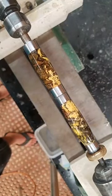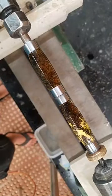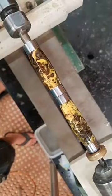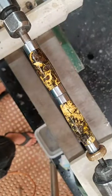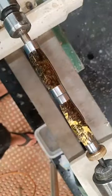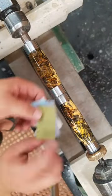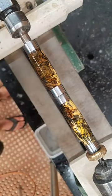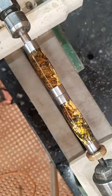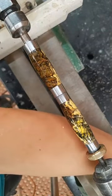Alright, so that is off the buffing compound. Man, it's nice. I still haven't hit the buffing wheel with it yet, so that's some pretty dang nice finish to have not touched the buffing wheel with it. So yes, I am a proponent of the Zona paper, and it looks like with this small of a sheet, even if you're wet sanding with it, you can get more than one application out of it, Steven. But if you're dry sanding, you will not. So just bear that in mind.